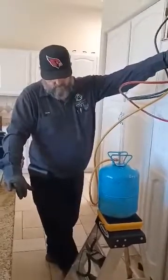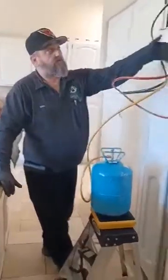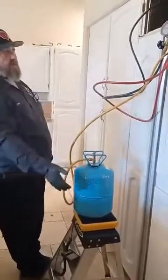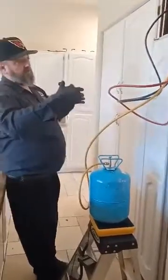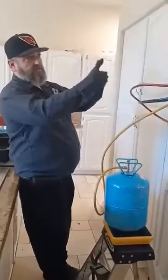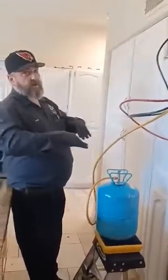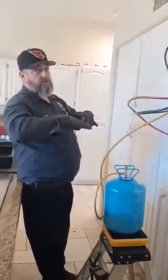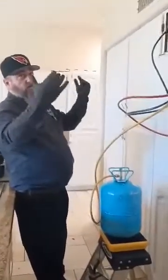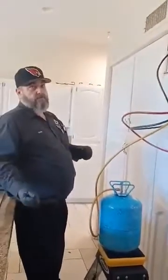Right. Where's the Yoder loop? The Yoder loop is the part of the high side that goes from the compressor down the center of most refrigerators, down the center into a pan underneath. What that does is it heats up because it's part of the condensing unit. It helps the gaskets seal and make a good close. It also sometimes has a drain pan underneath where water accumulates from the defrost. That heat on the Yoder loop helps expel the water so that you don't have to be emptying the drain pan every month like we used to.